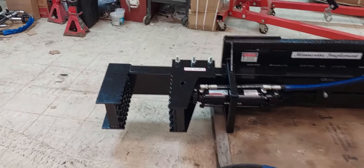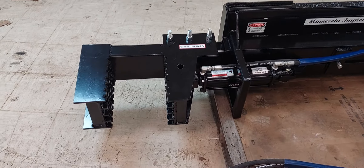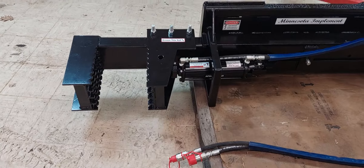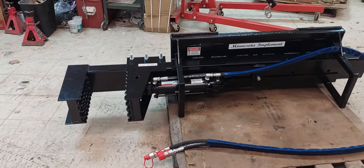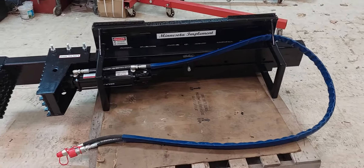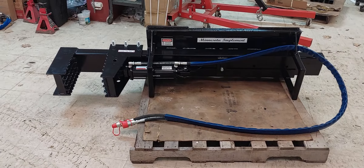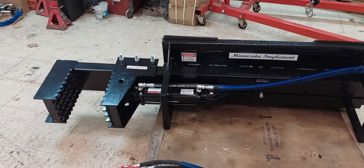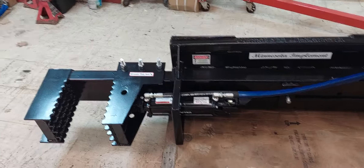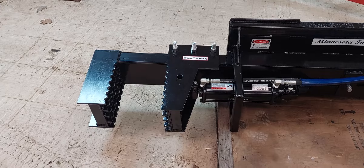Now if you're going to use this as a puller — let's say you've got a 10,000-pound machine — you could probably pull a four-inch tree right ahead of the tire. But if you extend that stick out to full extension and try to pull a four-inch tree, your machine is just going to tip over, and if you're aggressive with it, you could bend the stick. It was not intended for putting 15,000 pounds of pull force into a tree trunk at full extension.